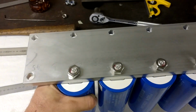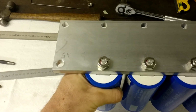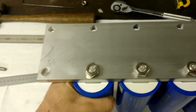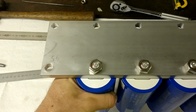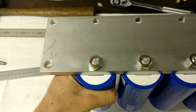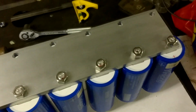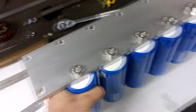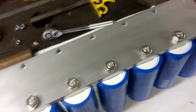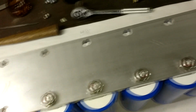I think I'm going to need to pilot hole drill, then step up a few millimeters, probably 3 millimeters, then step up 3 millimeters, then the 12 mil. Yeah, pilot hole, first drill, second drill, 12 mil. Might even have to go pilot hole, first drill, second drill, third drill, 12 mil, just to make sure that it stays centered. I could bolt the vise down, but then I'd have to unbolt it and rebolt it every time I wanted to do every one of these 14 holes, which isn't really going to work. It's not practical time-wise. Really starting to think that sending this off to get CNC machined was a good idea.